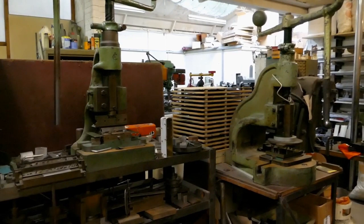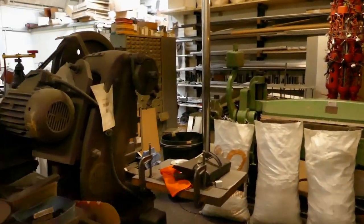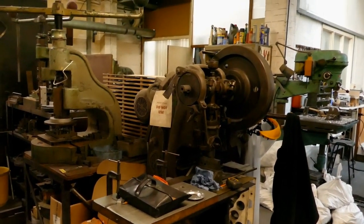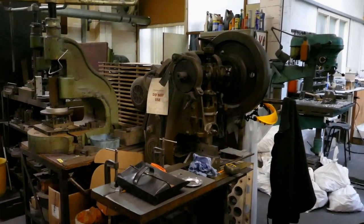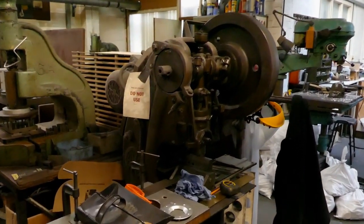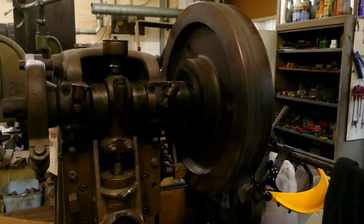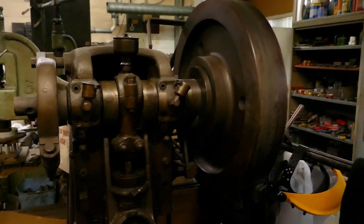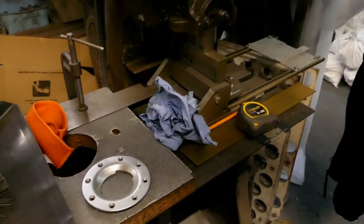We've got rather more fly presses than we need. A power press — a little 6-ton HME power press, which legally we're not allowed to use, hence the sign on it that says do not use. There are rules, regulations and laws in the UK about using power presses; they have to be inspected by qualified people. Once every couple of years that entails taking the flywheel off and inspecting the clutch mechanism, and the cost of doing that is more than the worth of the work we use it for. So we actually use this manually — you can just grab the flywheel and use it as a kind of horizontal fly press. We've still got our little guillotine hook set up on it.